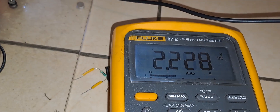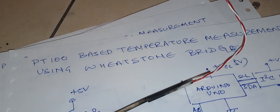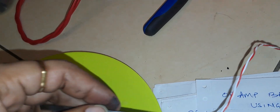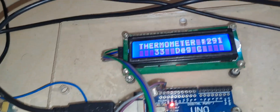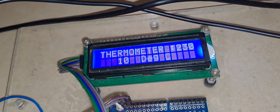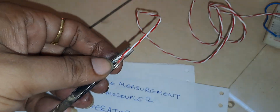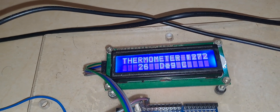Now I am going to show the sensor with ice simulation. The sensor is still hot — it is reading 70 degrees — but I will put it in the ice. I have put the sensor in ice. You can see the temperature is reducing: 10 degrees, 5 degrees. You can see the voltage here — it became 0.8 volts. This is how the circuit is behaving. Now I have taken out the sensor from the ice and it is slowly slowly increasing.